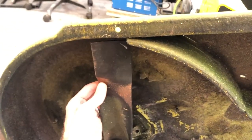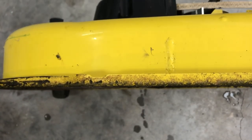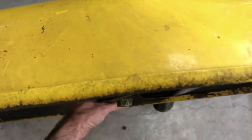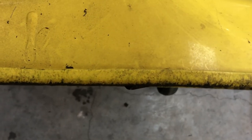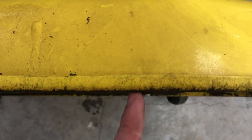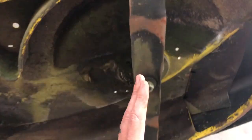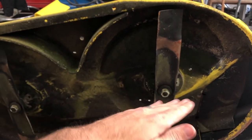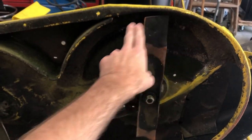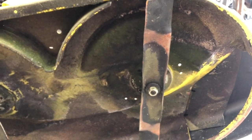But if we rotate this one around and look from the straight back side of the deck, line up the back edge and front edge — all looks well. Do that same thing to this side: line up the back edge and the front edge, and you can see the blade tip sticking down below the lower edge of the deck. So instead of being bent side to side, this is front to back. This blade on the very back of the deck is cutting shorter than the other one.